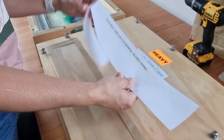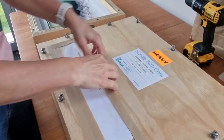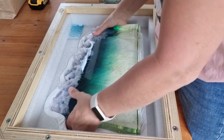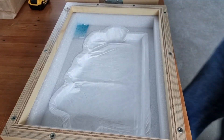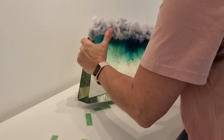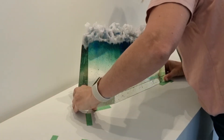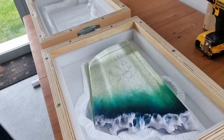Put the template away. Remove rings from fingers and use the hand-held slots in the crate to lift the glass. Place the glass in position where your masking tape marks are. Do not slide the glass or you will scratch the bottom.